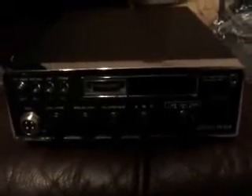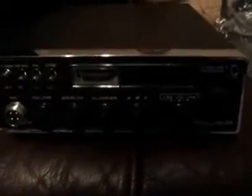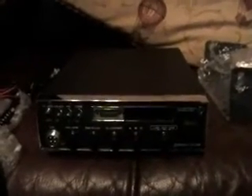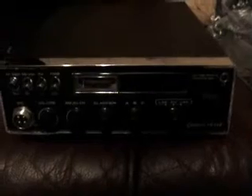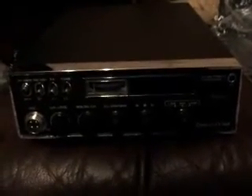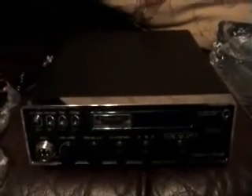There's a speaker — you can see the chrome's gleaming. No scuffs or anything. So yeah, Kernel FR360 — absolutely beautiful radio. They're not as desirable as things like Cobra 148s and Presidents, but a very good radio all the same, from the golden age of 11 metres operation. They roughly do about 12 watts PEP all day long and they're very well made — made in Japan. I think roughly around 1982 to 83 was the year I got one originally, and at that point the retail was, I believe, between 250 and 275 pounds — quite a lot of money in those days. M0OGY, 73s, and thanks a lot. Bye.